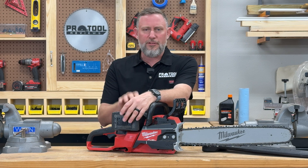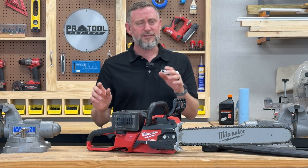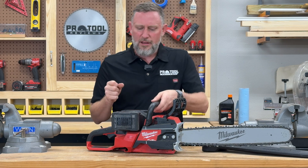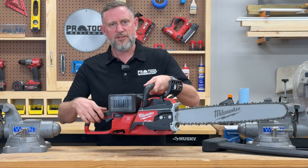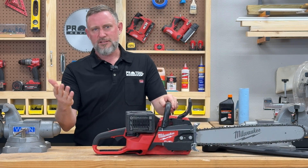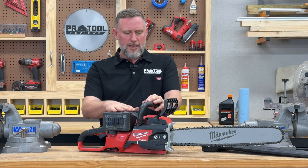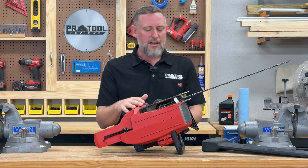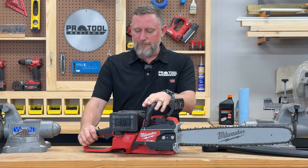I was able to get our tasks done without having to go get the batteries recharged — it was right at the very end when I noticed we were down to one bar, so I was really happy about that. As far as balance, the saw is not a light saw — it comes in with the two batteries installed at just shy of 21 pounds, so it is heavy. But it's balanced well. When I pick up the saw from the center handle, it's balanced — your front hand on the front handle is carrying most of the weight and your rear hand is using the handle to maneuver and operate it. The trigger safety works fantastic, very simple and easy to use. I had gloves on the whole time and was able to manipulate the saw without issue, including changing the speeds. The wrench stayed in place and didn't fall out at all. As you can see, it's clean inside — all the chips evacuate out, nothing got clogged up inside the guard.